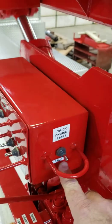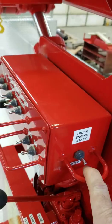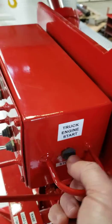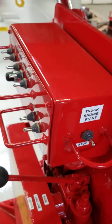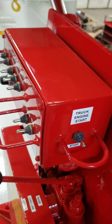When you're ready to kill the truck, just reach up and hit your stop — that shuts the truck back off. When you're ready to start again, move the switch up and down a couple times. As soon as you hear the beep, stop, and the PTO fires back up. You're ready to go to work.